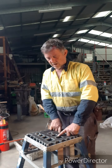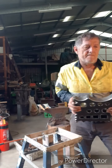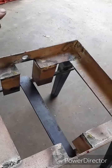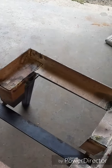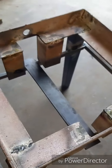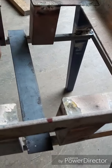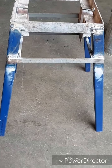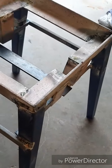Let's just lift this out and have a look. Basically what I've done is I've used some fairly heavy-duty 50mm or two-inch angle iron around the top to hold the frame, a couple of down tubes, a support brace across the side, one across the middle here, and to stop the legs from spreading when I'm bashing the living daylights out of it, a bit more of a brace there.